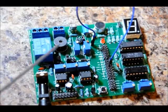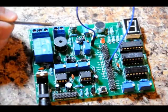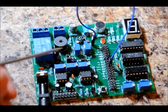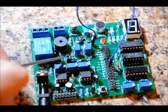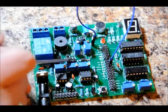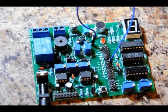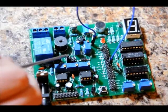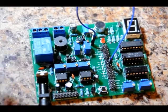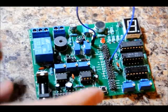Now for the actuator setup. This is your actuator area — we have your relay, your buzzer, and your motor driver port. There is a 3-pin jumper down here labeled Buzz. The two pins on the left are for the buzzer, the middle pins are labeled RLY for relay, and the rightmost pins are labeled MTR for motor. We need to make sure our 2-pin jumper is on the two left pins — and they are right now — so that when we put our pulse on the actuator pin, the transistor is driving the buzzer.